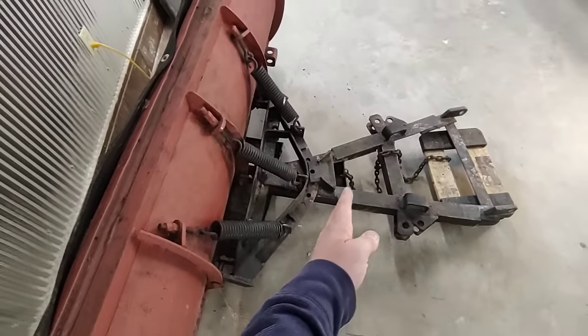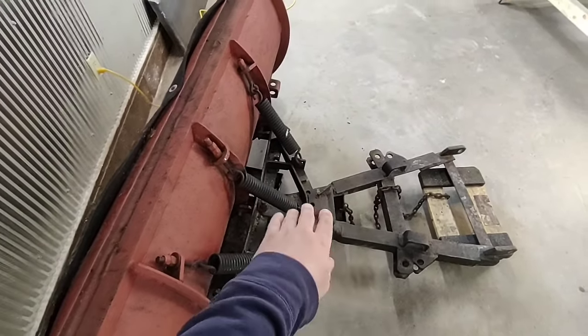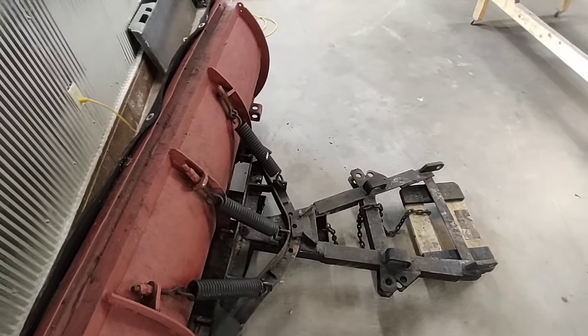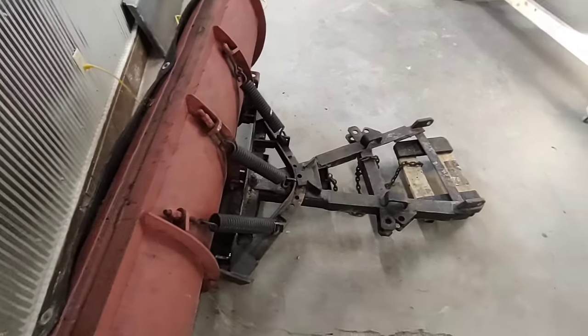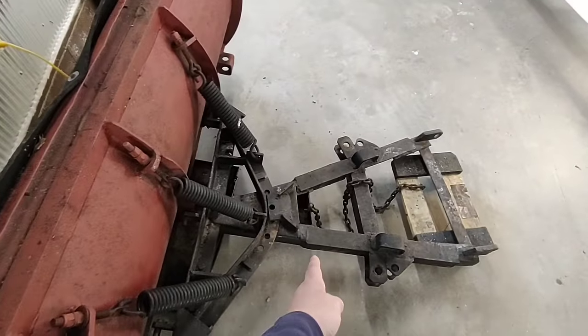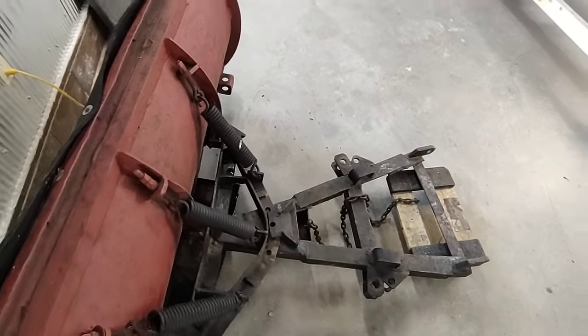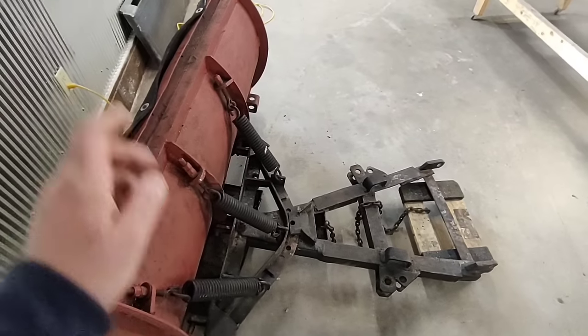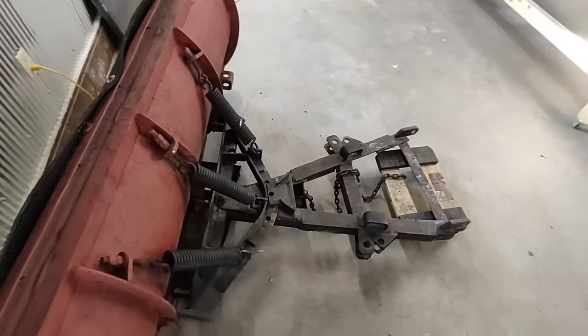I want the plate as close to the plow as I can get it, just so it's not hanging out there heavy, flopping around. So this way, with getting rid of the hydraulics, it's just easier. So what we're gonna do is make some marks here. I'm gonna take the portaband saw and buzz that off and just throw this away. And then we'll line it up on our quick attach plate, tack it, and do some bracing, see how it comes out.